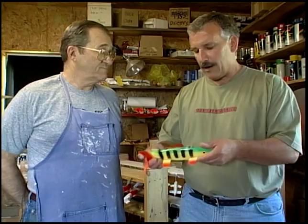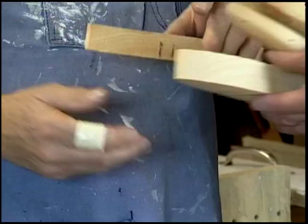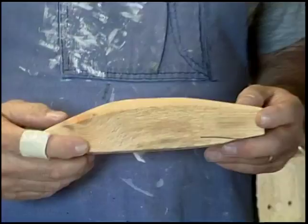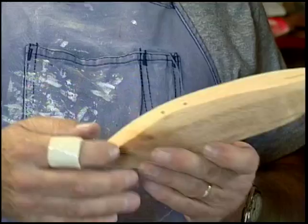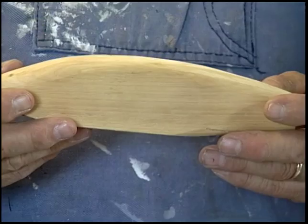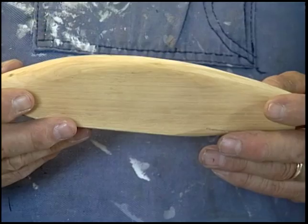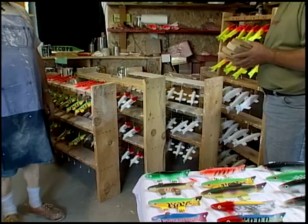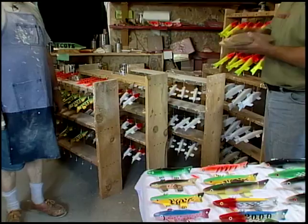Why don't you explain to us how do we go about making something like this? First you cut it out and you stay at least two inches away from any knot. Then we go over to the drill press first. This is what's called the lead slot. Then we're going over to the band saw and we're going to cut the slot for the tail and cut off all the excess. I do mine on a very coarse, large sander — 60 grit. And I can rough them out in 60 to 90 seconds. Last week's work right here — one week's work, 102. I missed three over there, otherwise I would have had my normal 105 or 106. And then all these eventually are going to be packaged and sold to major distributors.